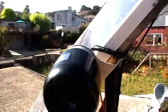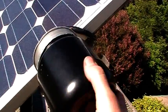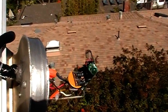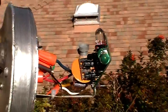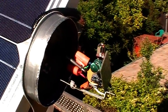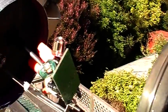Over here is the tracking system — the solar tracker. You can get these from Red Rock Energy on the internet. A guy by the name of Dwayne Johnson sells them. What it does is send an electronic pulse to the linear actuator about every 30 seconds so I can track the sun. What's pretty neat is that when the sun goes down, it automatically goes back and parks in the east to wait for the sun to come up again in the morning.